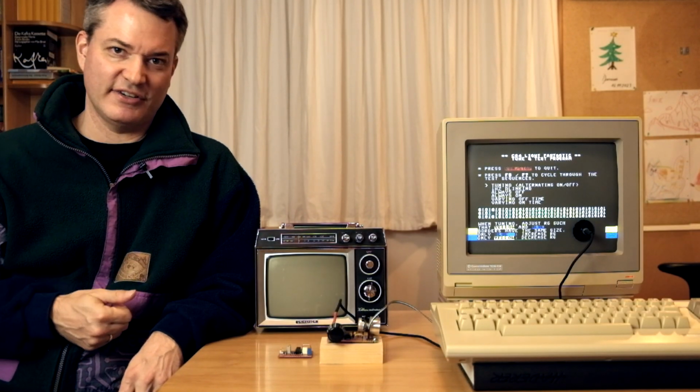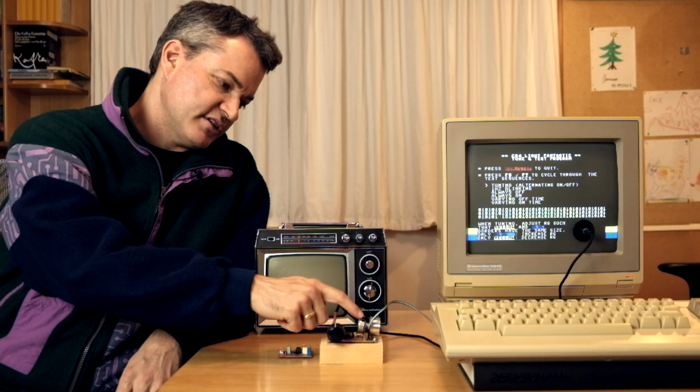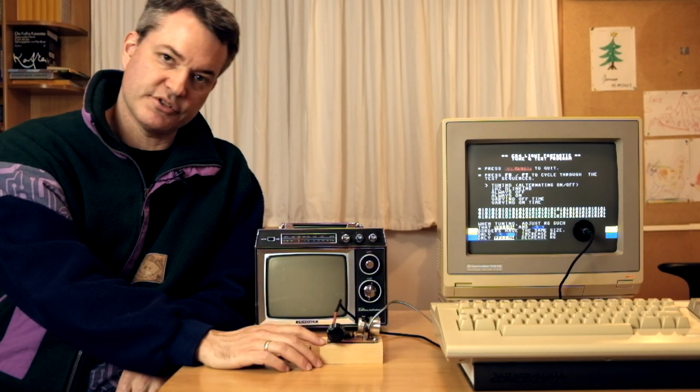So what can we say with hindsight, looking back to 1985? I think the original experiment would have had a fair chance of success if it wasn't for the two showstoppers we found. The C64 receiver program was missing a crucial part, and the wrongly specified potentiometer would have made it almost impossible to tune the circuit correctly.